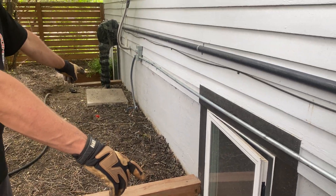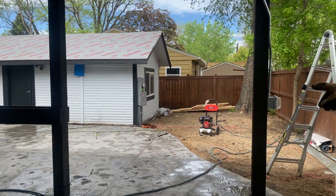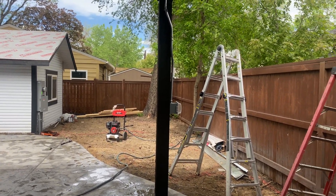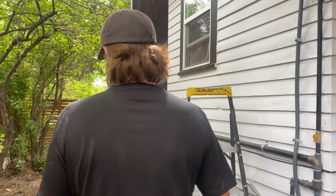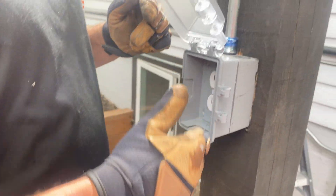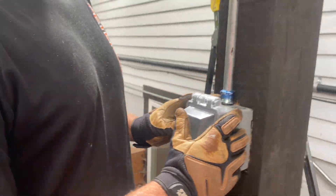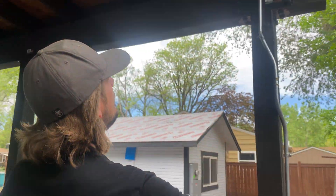They made us drive two more eight-foot ground rods. I had two over here on this building 40 feet away — it doesn't matter, they wanted it. It's kind of redundant to me to have that many ground rods, but the service is there and this is the home structure, so I might have to have four ground rods totaling 32 feet.